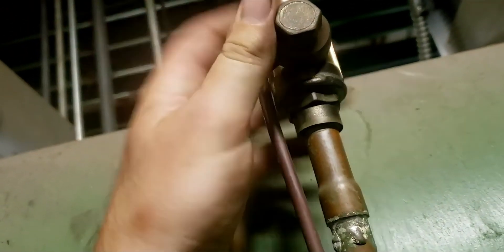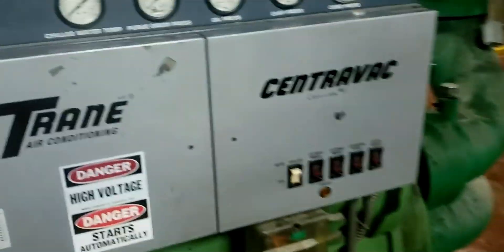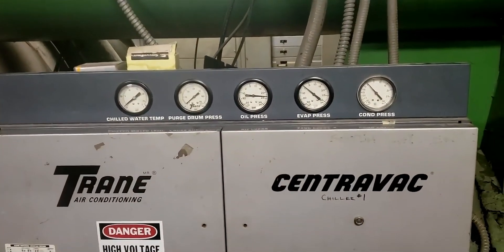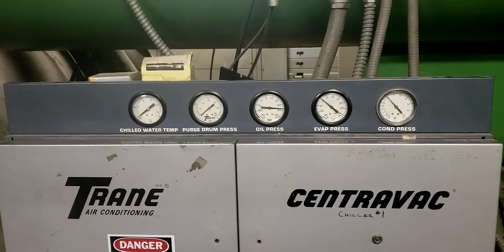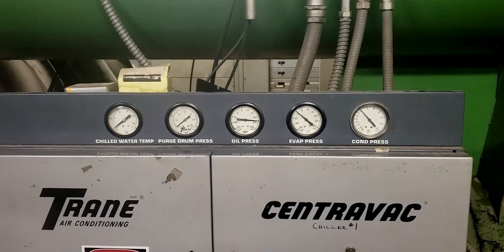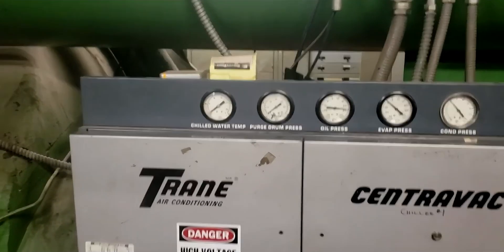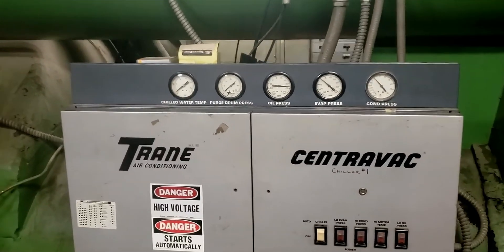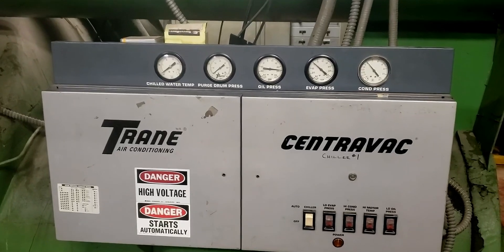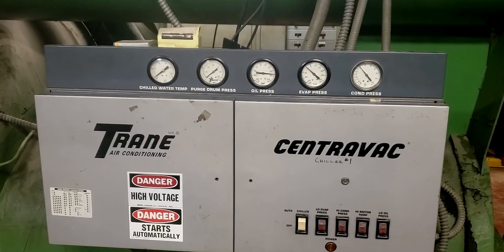And this ball valve's threads here — so we sealed this cap up. What we're going to end up doing is the purge unit has got to purge this thing back out. I'm probably going to give it about a week, just let it sit there and cycle the purge and do what it needs to do. After that week's time we'll come back and try to do another startup on it. Right now if I try to start it up it just starts surging really quick and won't stay online long enough.